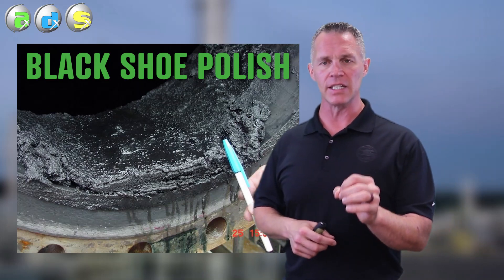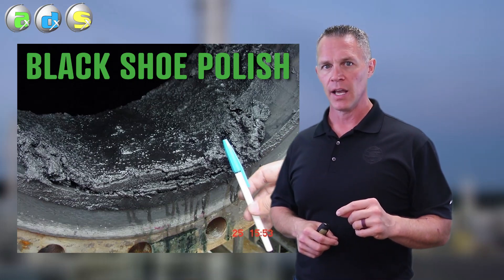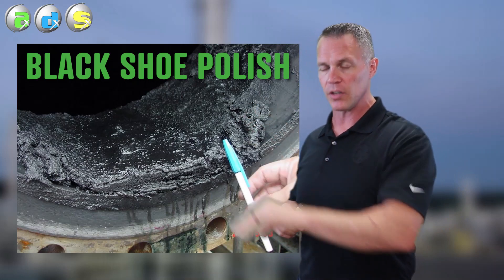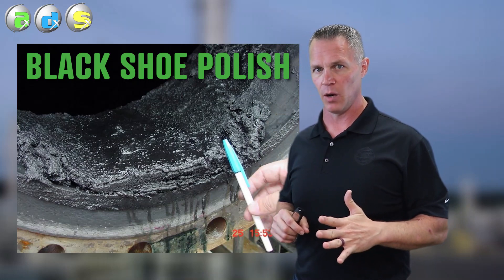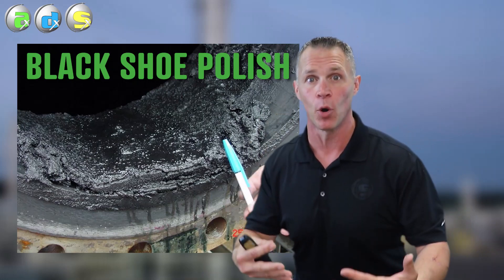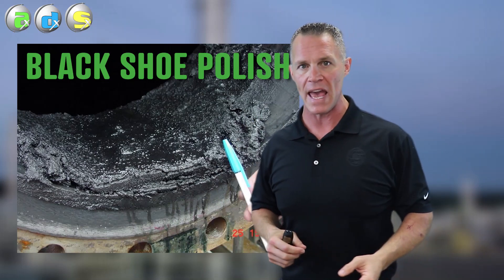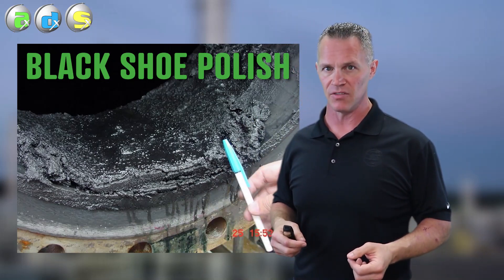Mackinawite is the initial formation of iron sulfide where the ratio is mostly iron with just a little bit of sulfur. The H2S has just started to attack the piping walls and forms this mackinawite. But the problem is it doesn't form a protective film because it's very porous and also somewhat soluble. So it forms on the piping wall and then the amine just washes it away again - that's hardly considered a protective film.